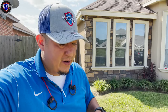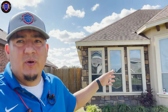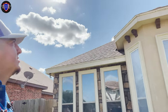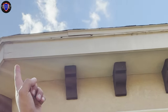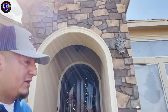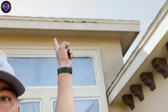On this home we began by pressure washing — all the pressure washing has to be done first. Then there's some stucco repair we are doing; there are some corners that are chipped, and there's some one-by-two up on the fascia that needs repair. That happens because the flashing on the roof is not adjusted properly or has an opening, so water gets in, causing water penetration and wood rot, as you can see up there.